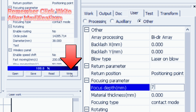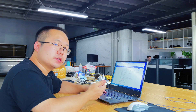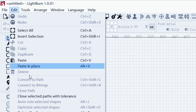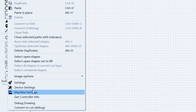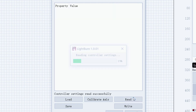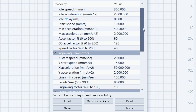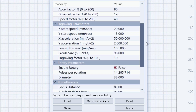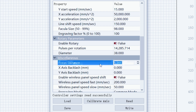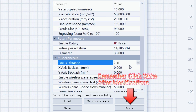If you find that your latest optimal focal length is 7.8mm after testing, you can change it to 7.8mm here. As for LightBurn, the principle is the same. First, select the Edit menu, then click Machine Settings, and select Read to read the parameters of the linked machine. Here you can see the focus distance, which is the place to set the focal length. Similarly, you can change it to the parameters needed, such as 7.8mm.